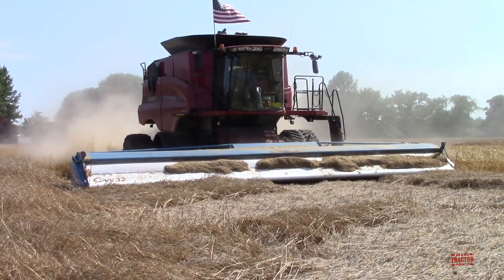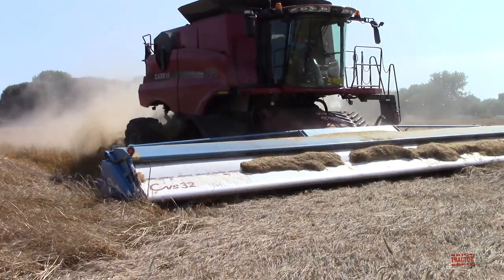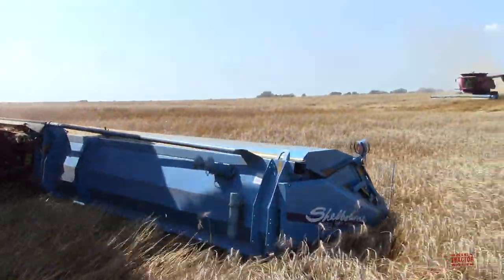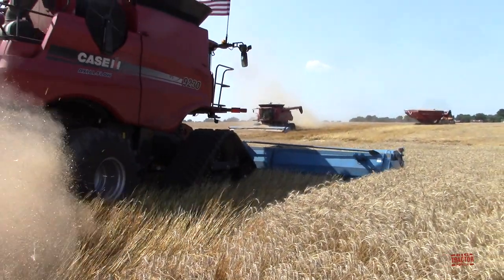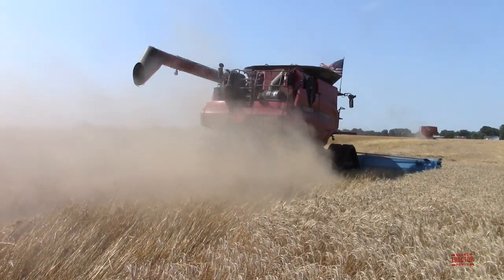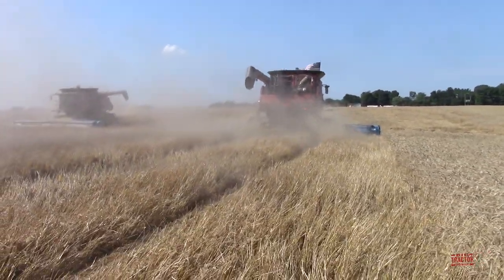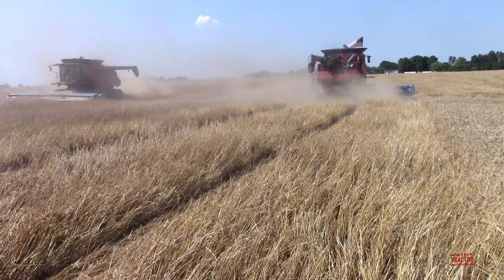The Shelbourne Reynolds stripper head threshes 85% of the grain right in the header. It uses 8 rows of fingers to comb through the field, just raking out the grain in the head of the wheat and pulling that into the auger pan of the header and then feeding that through the combine. Very little material is actually threshed by the combine. What you see coming out the back is mostly just the husks around the grain of wheat that are threshed out by the combine, with the rest of the straw left standing in the field as the harvest progresses.